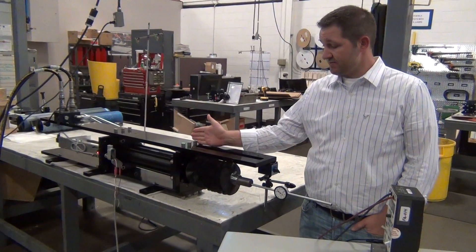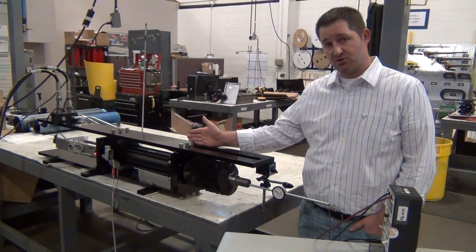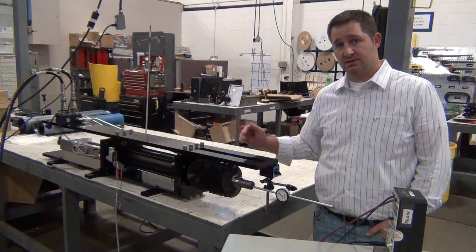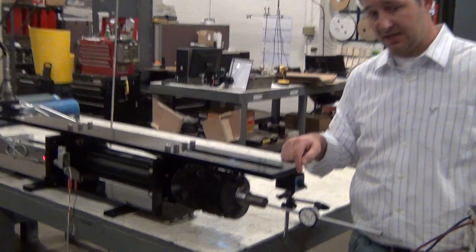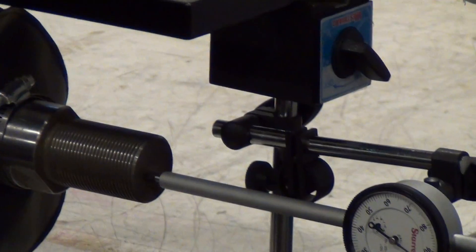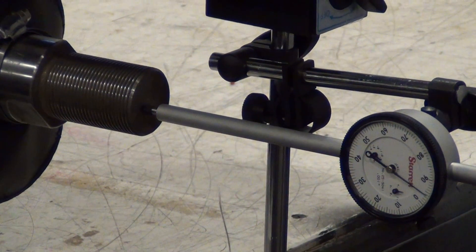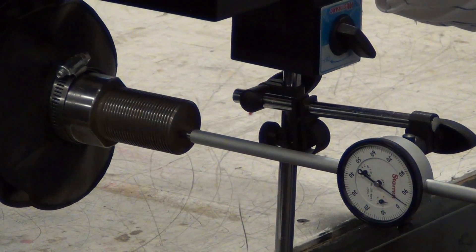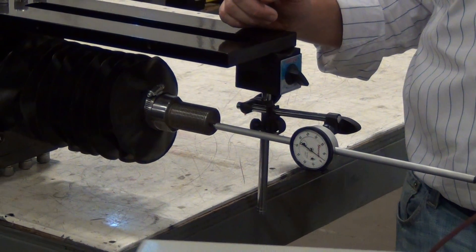This actuator is rated for 10,000 pounds of force and puts out a rated stroke of 11 inches. Stroke speeds are around one second open and close. Repeatability is 0.1% of span. The technology is designed to eliminate oil maintenance and complex filtration systems that are continuous maintenance issues in power plants and one of the number one causes of unexpected trips and shutdowns of steam turbines.